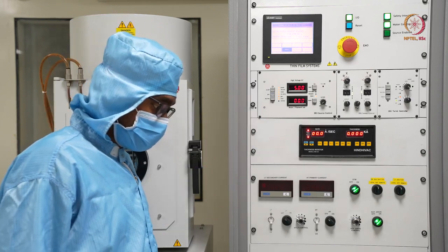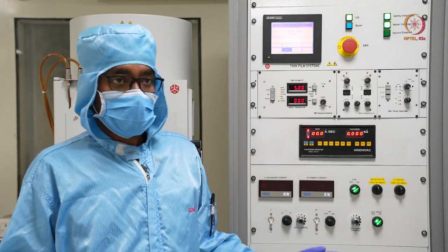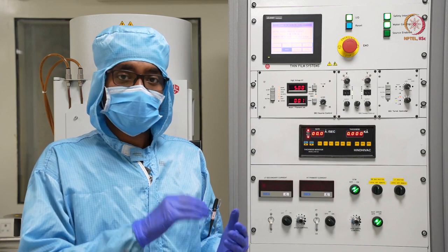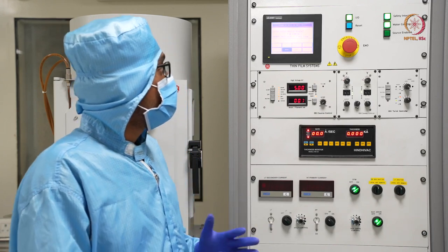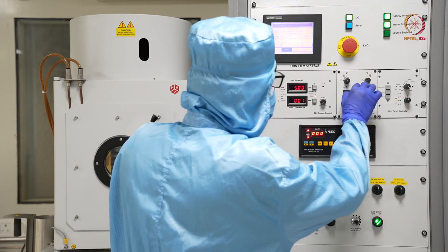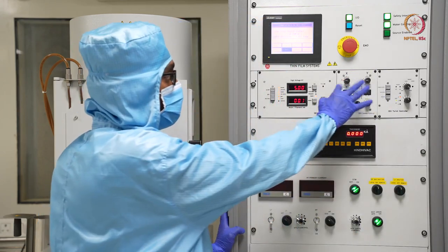Platinum deposition will require much higher current than titanium — it can take up to 200 milliampere. So until we reach 200 mA, since the current level is higher, we have to go through many more steps. We should introduce more steps so that thermal shock will be minimized. Let us proceed. All systems are going, so we are good to go. We will reduce to the level that has been set for this material.